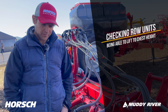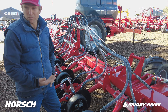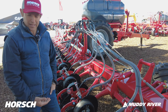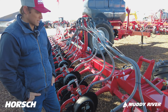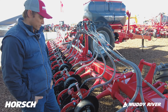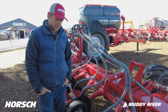You can lift the units up to chest height to check the discs. We do an airflow check — we've got very sensitive blockage monitors. In some really wet conditions we've actually lifted this little rubber wheel up, pinned it, and used it as a straight press wheel like a tine machine would be. To check your seed boots is as simple as lifting up and walking along with your hand underneath. No issues at all — very user friendly. Nothing worse than a blocked unit or a blocked row.